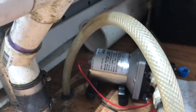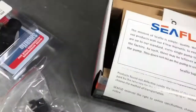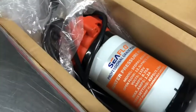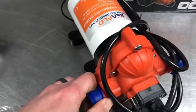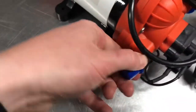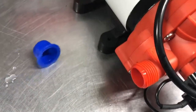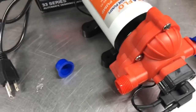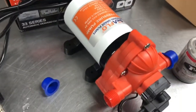What we're going to do is replace it with this pump here because it is wired for 120-volt — a normal U.S. plug. The reason we want to do it that way is because if the pump goes bad on us, we're going to have a backup on the truck. This is about as easy to install and uninstall as a fixture on a garden hose. So if something goes wrong, all we have to do is unscrew the old one, put the new one in, plug it into the wall, and keep going with service. Lesson learned: don't try and save too much power because it gets difficult for your staff to fix things on the move.